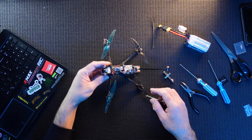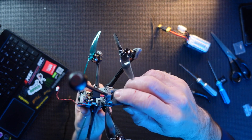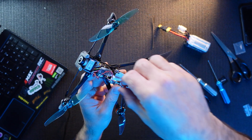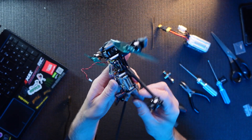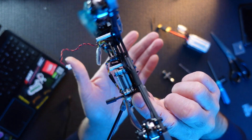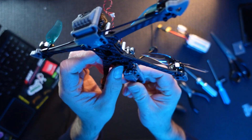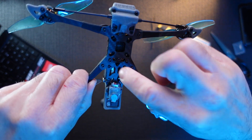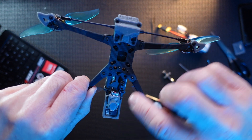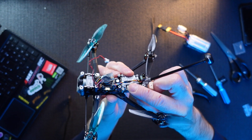Just before I put the top back on, everything's back in place - the power cable's quite nice. I've tidied up the cables that did have some sticking out the back over the GPS unit as well, which probably wasn't the best. Caddx Vista over the top, so hopefully that just takes them out of the way completely. There's now quite a nice bit of separation from the power cable. GPS cables are there, and I've separated them by keeping the power cable as far over as possible. There really isn't any room to put any padding or another layer in there, so it's really quite tight.